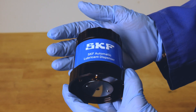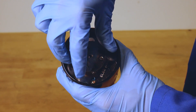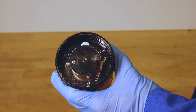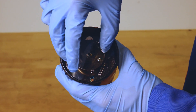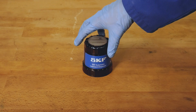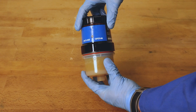The TLRD piston is engaged by a rotating pressure plate which must be correctly positioned prior to starting the device. The pressure plate must be turned clockwise until it sits fully retracted at the top, and then rotated back approximately three quarters of a turn to ensure that it will sit properly on the piston when reassembling. After positioning the pressure plate, the filled grease cartridge can be attached to the lubricator body — make sure it is properly tightened.